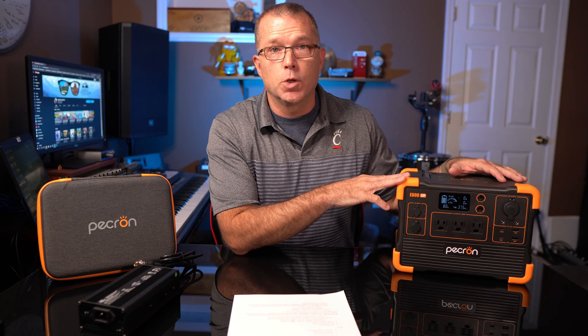Another option is the included 12-volt car adapter. That's going to take upwards of six hours or so to charge through your car's 12-volt port — a slow option, but useful if you're driving around a lot. It's actually a great way to power a 12-volt refrigerator while constantly renewing the power it consumes. In terms of solar, this thing can handle up to 500 watts of solar input. However, if you're connecting multiple panels, at least in this revision, you do need to connect them in parallel, not in series — a BMS limitation they may change in future iterations.